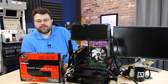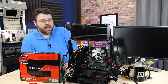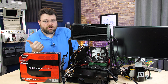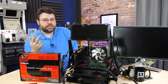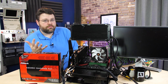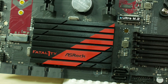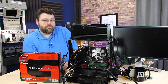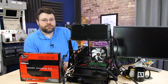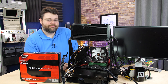In our preliminary testing, this AB350 motherboard seems to be pretty solid — I'm pretty impressed with it. I would love to see error correction memory support in a UEFI update, but there is P-State overclocking, SRIOV, and IOMMU support. The UEFI is one of the more full-featured UEFIs I've seen, especially on a B350 chipset. But for now, we've got more IOMMU testing to do — this should be interesting. I'm Wendell, signing out. I'll see you in the forums. Come help me build a list of graphics cards that work. See ya.